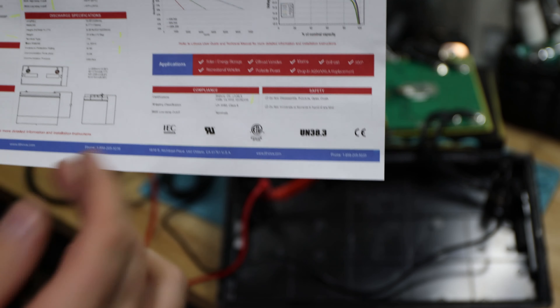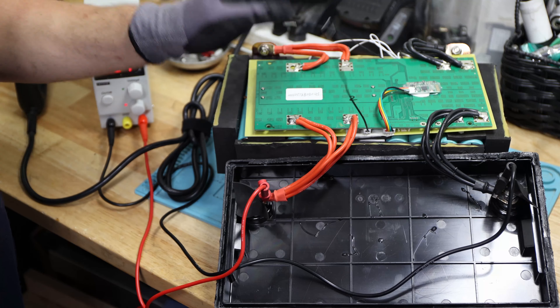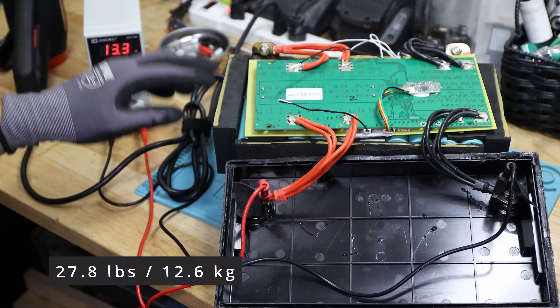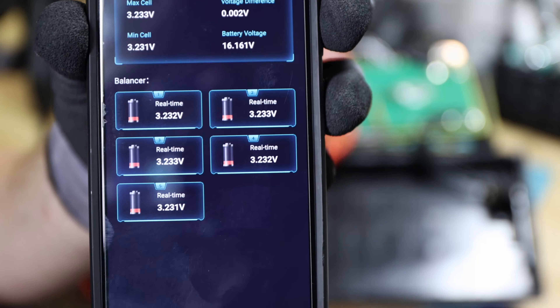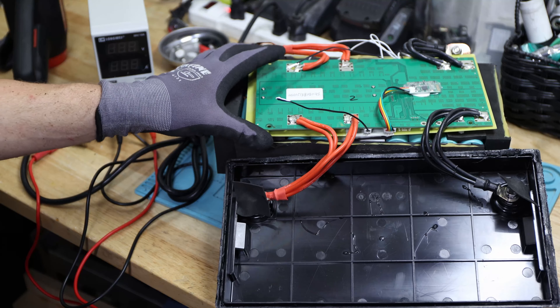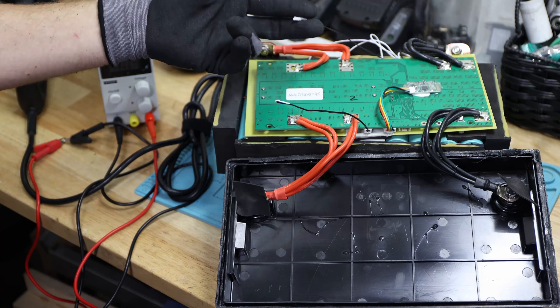It does not have prismatic cells but also does not have pouch cells. It comes with what they mentioned in the specification sheet — so that's good. It says UL certified with the ETL or Intertech mark. There was more information about lithium iron phosphate battery. At this price point, having Bluetooth and high-temp and low-temp charging cutoff is amazing — it protects the lithium iron phosphate cells. Even though there are more cells than you'd expect, this one might be a little heavier. It appears to be in a 4S configuration, which is more normal.